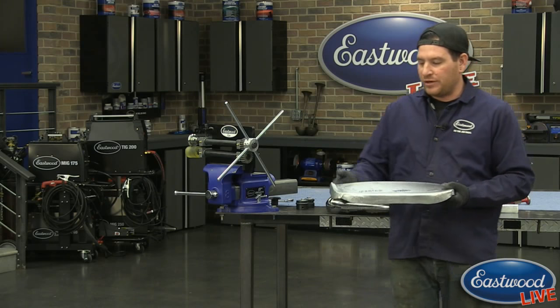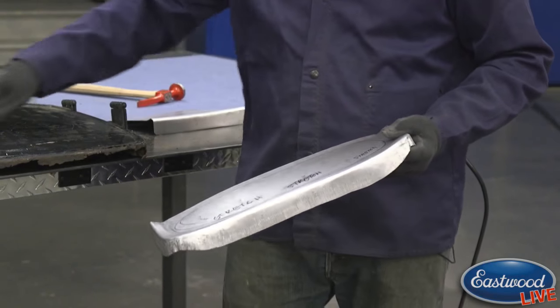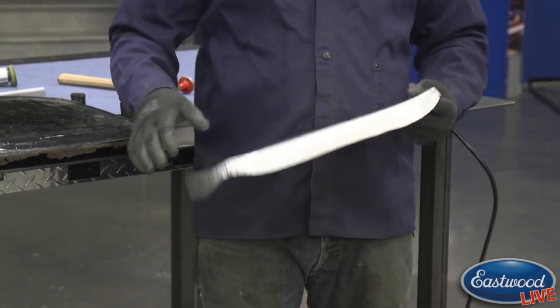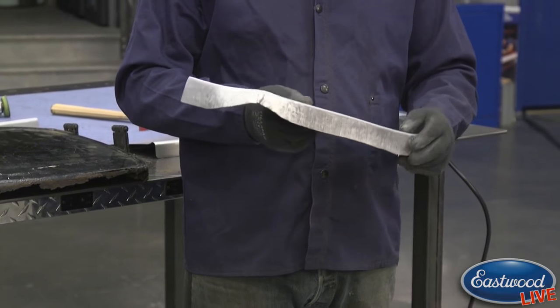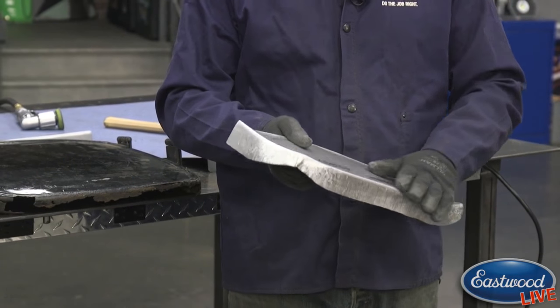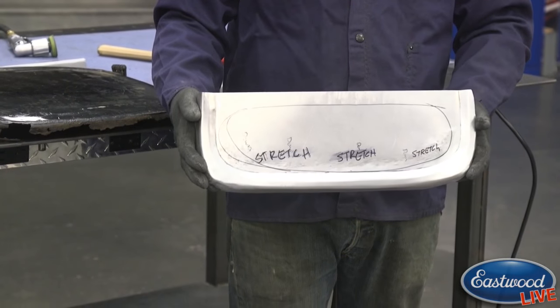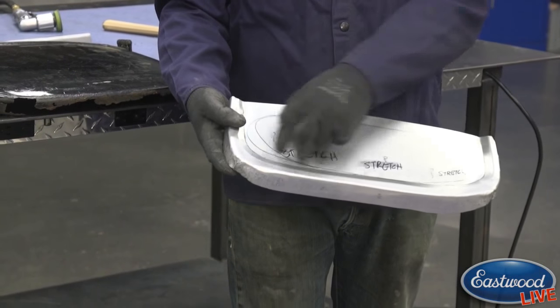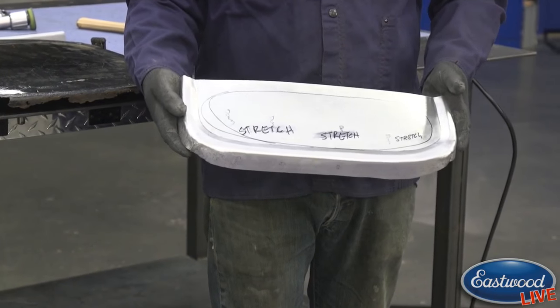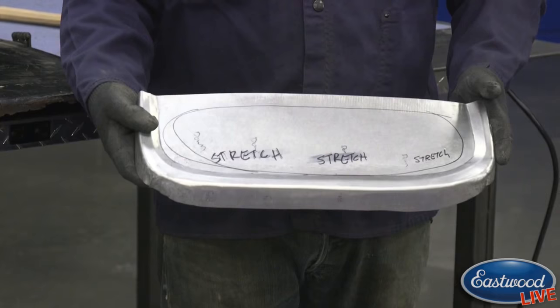This is a piece, if anybody's wondering, I just showed you guys how to make a sample piece for the center here. I figured we'd have somebody that might ask about the corners. To do this piece out of corners, with the corners in one part, is quite a lot more work because a lot starts happening here. I roughed in a piece yesterday to make this same exact process. I have some notes here where I need to put this on the planishing hammer or the shrinker, or I'm sorry, on the wheel, English wheel, to get it fine-tuned.